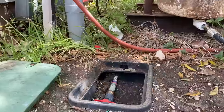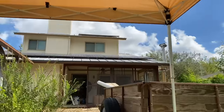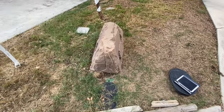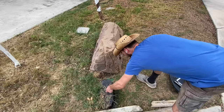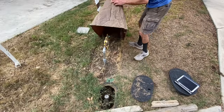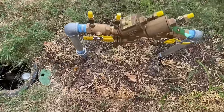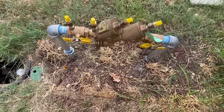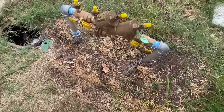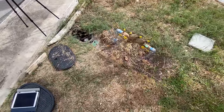Once the rainwater joins this pipe here, it feeds into all the pipes in my house and it flows out of every faucet, toilet, and showerhead. A safety feature worth mentioning is the fact that we installed a backflow preventer out by the municipal water meter that makes it impossible for my rainwater to flow into the city plumbing. This feature is both logical and required by most municipalities. It's one of the many safety mechanisms aimed at keeping the city water clean. This little guy also has to be inspected on an annual basis to keep up with the rules.